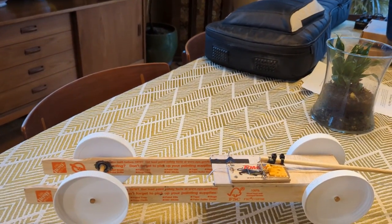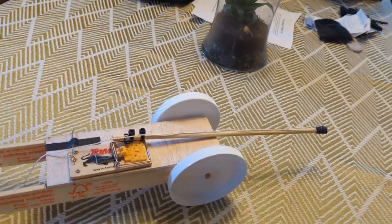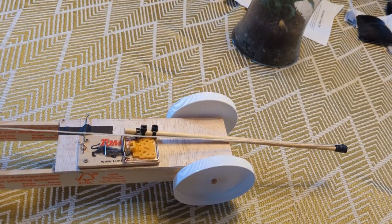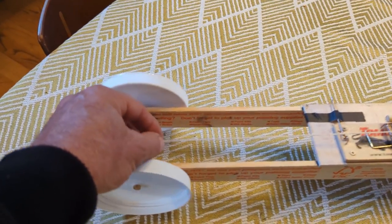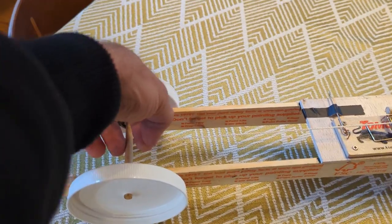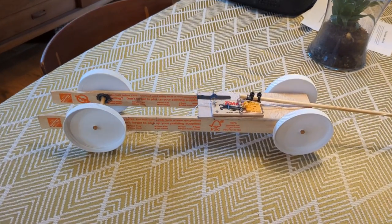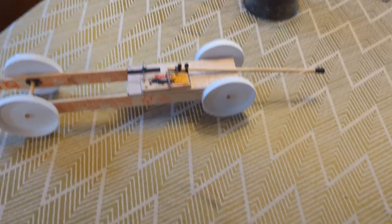It'll take a little bit of work, but it'll fit great and you won't have to use glue to secure it. Then this is just some nylon string. A lot of places are saying use dental floss or whatever. Not recommended. Use a nylon string right there. And think of this as being fully expended from an energy standpoint. As if that lever was all the way back, it would be fully loaded and ready to go. And you'll see that this thing is just short of the axle, so that when this lever travels its full excursion, it will completely remove the string from the axle. And that's pretty much it. It's a simple design, but it will work.